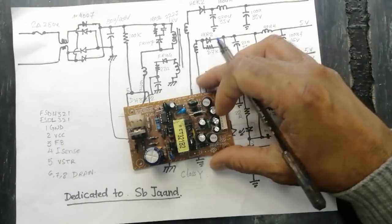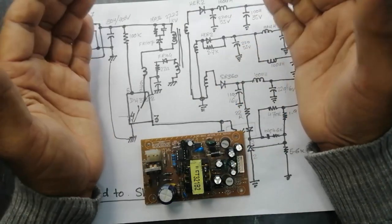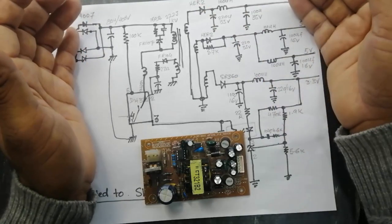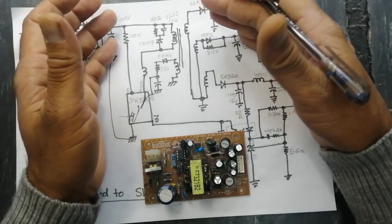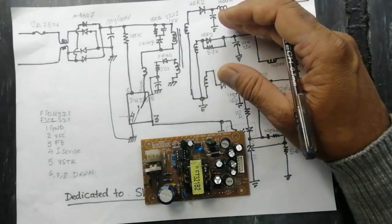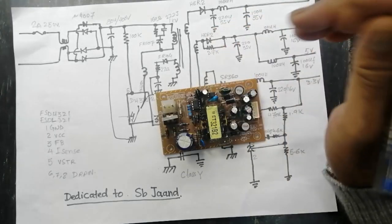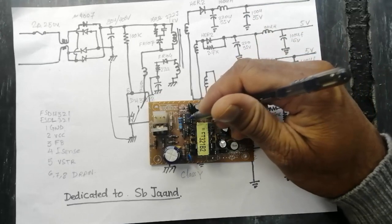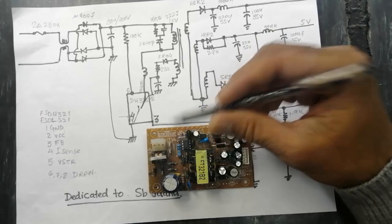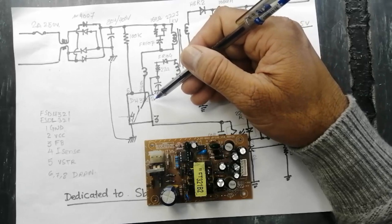My idea is to share the details and circuits so we can get an idea of how a circuit works. When we know the circuit combination and the basics, we can approach any circuit whether it is complicated or simple. This SMPS controller is basically a current mode controller but it is also used in voltage mode. It is the DH321 with a 120 kilohertz oscillator.